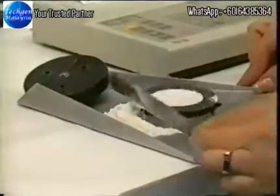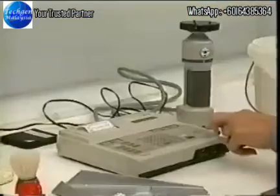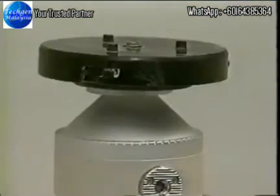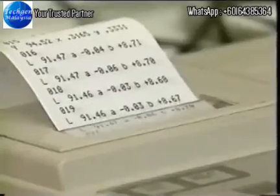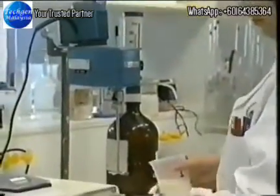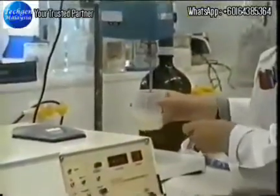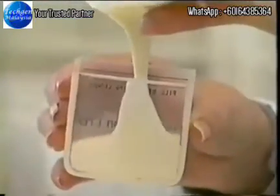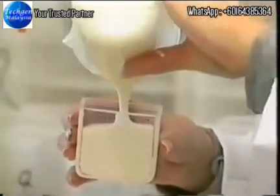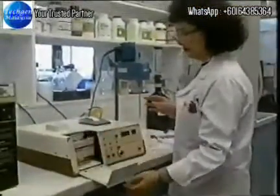Flour colour is a measure of bran contamination. The higher the bran content of a flour, the darker the colour. Tri-stimulus colour meters are used to measure the colour of dry flour. The Kent-Jones colour meter measures the reflectance of a flour water paste.